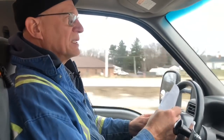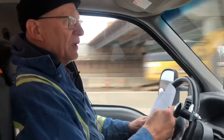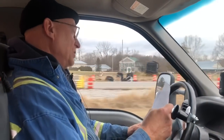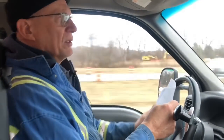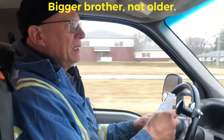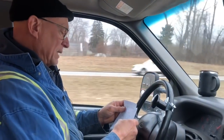Mike Skinner found a 70-tonner that is a GE, more of a branch line locomotive. The cab is at one end. It had a big Cooper Bessemer engine in it. I think a 6FL, FLW, something like that. Those are hard to find parts for. Its older brother was a 95-ton GE, which is an industrial switcher, had a lot of capacity.